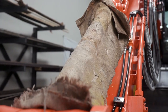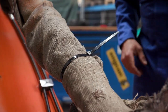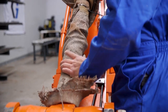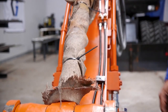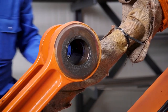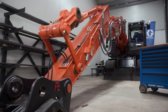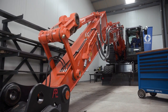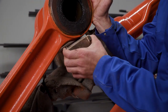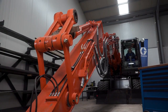It is important to protect the factory components on the equipment. Using heat or impact guards to protect components during the assembly, disassembly, and modification stages is critical. This individual is rotating the H-link to allow for simplified access to the various parts of the excavator and to streamline the installation process. As you can see, he's moving the hydraulic cylinder to allow for more space in the work area. He is also taking care to protect the equipment from impact damage by using spacers and protective covers on the polished hydraulic cylinder.